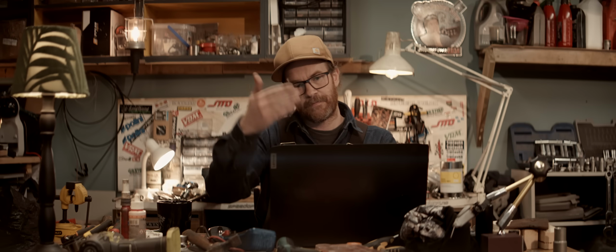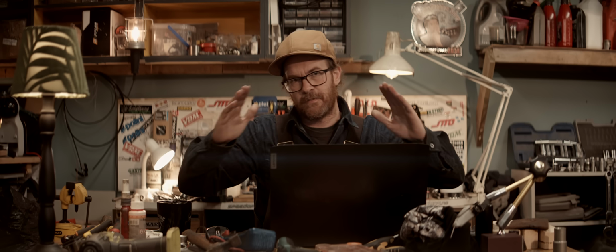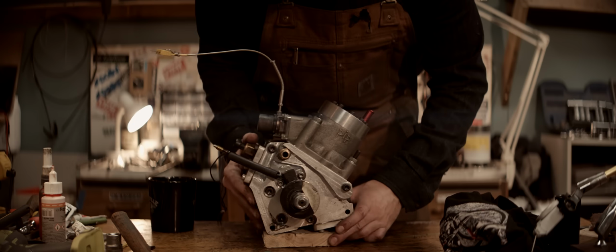There should be a picture of the Aprilia RSA on screen now, with the exhaust port and the A transfers, and you can see how it doesn't differ much from my layout. Actually, there's more separation between my A port and the exhaust port compared to that Aprilia. And my upward angles, all the A, B, and C transfer ports, are pretty much standard. We'll have to pull the engine out of the frame and pull the top off, and then have a look there and see if I've screwed up port timing in a major way or something.